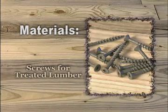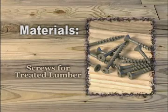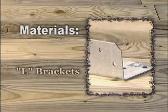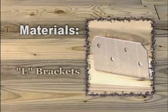You'll also need the correct fasteners for the wood. Look for screws that are designed to be used with treated lumber. It'll say so right on the package. You'll need a small box of number 8s, 1 1/4 inch long. For the arms, we'll be using these little L-shaped brackets. They'll give them a little more stability.